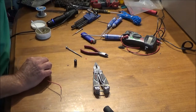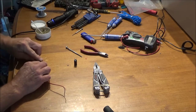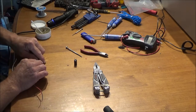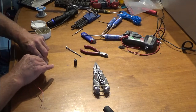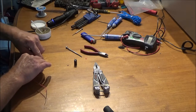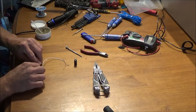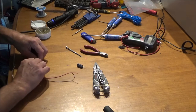We were going back and forth, couldn't figure out what was causing it, and I ended up with some radio issues — everything went screwy. I asked if I could take two 3 amp BECs and tie them together into a Y adapter to get 6 amps at exactly 6 volts. The tech at the store said nope, don't even think about it — things would go real bad. So that wasn't going to work, and that brings us to this video about glitch busters.